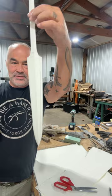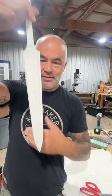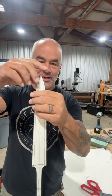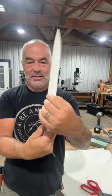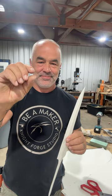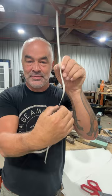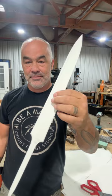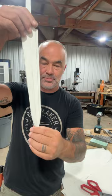All right. Another thing about daggers, when you make one, daggers are cutting from the point. So all this, you can make it sharp if you want, and you should make it sharp, but it doesn't have to shave hair. But this part right here, you should be able to draw with that thing. And that's one of the funny things. I see a lot of times people make daggers and they're too thin. They're like an eighth of an inch thin. So this is going to be about 10 millimeters thick right here, and it's going to taper, and there's going to be some interesting effects, and the point will actually go and be thicker again. So the point will end up being thicker. And that's something else that I've noticed on old daggers, like Quillon daggers and some old daggers. The points are robust for poking holes through armor or dragons or whatever.